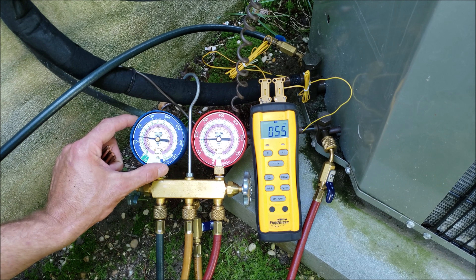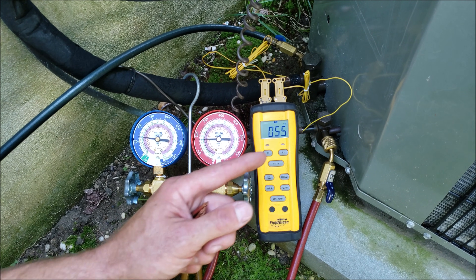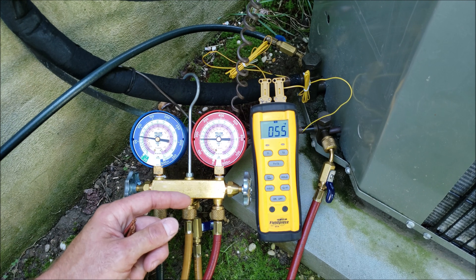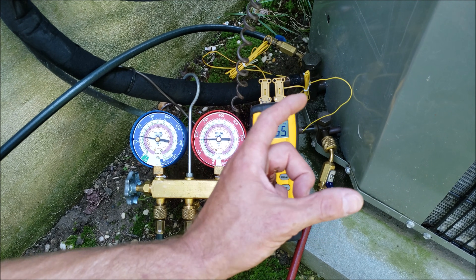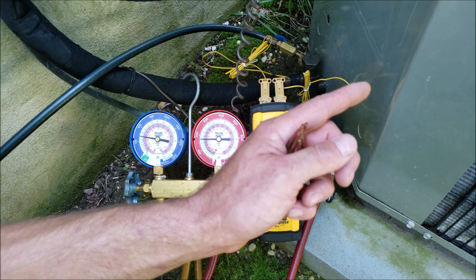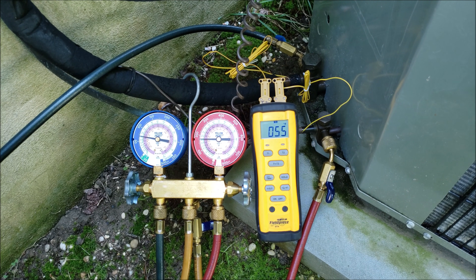And if you're guessing, the system may have a problem with saturated refrigerant entering that compressor. You may have overcharged the system, and when you overcharge it, it's just leading to very bad electrical efficiency. Also, if you overcharge the system, it's not going to be able to remove the heat out of the refrigerant at the outdoor unit effectively, so you're lowering the capacity of the unit.